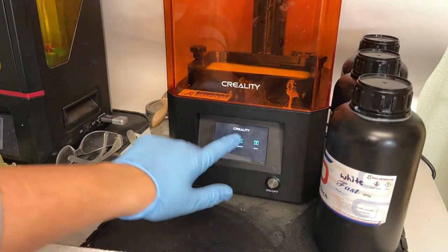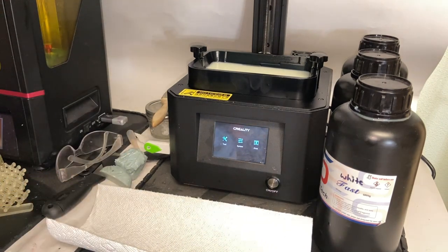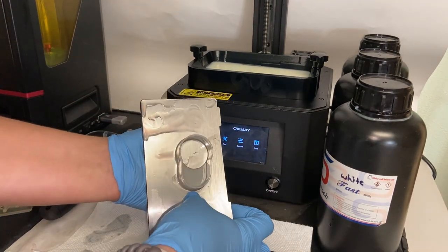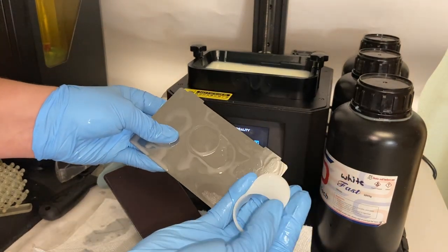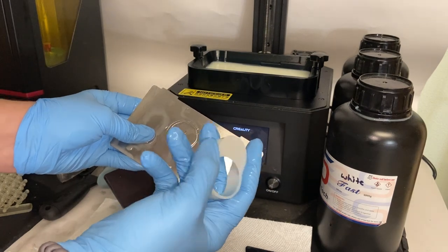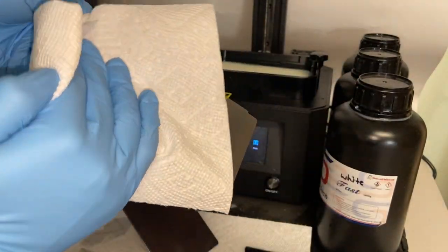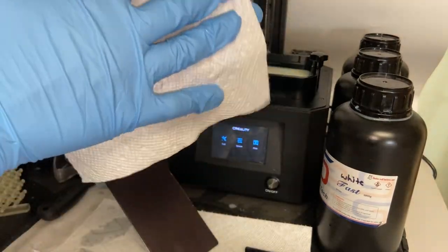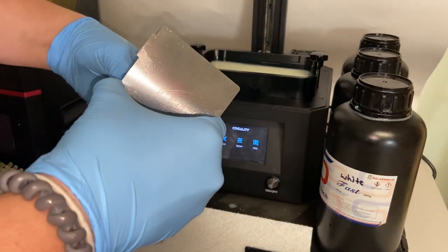The print is done — it took about two hours. I'm just going to take the bed off and check out what we got. I have a piece of paper towel here ready to put the build plate on. As you can see, we have a print on here. I'm going to pop it off — and it came off really easily. Now I'm going to twist it, and just like that, you have a flat piece that came off flawlessly off of this build plate. Before you put it back on the magnet, all you have to do is make sure you clean the side that goes on to the magnet, and then place it back on and put your bed back on to your printer.